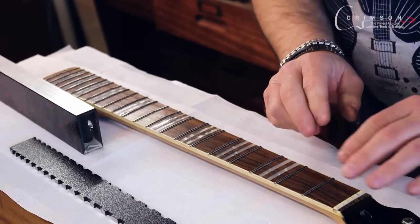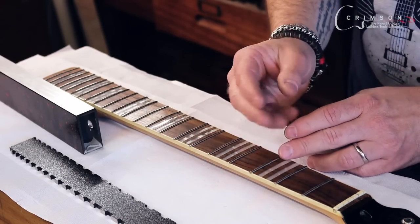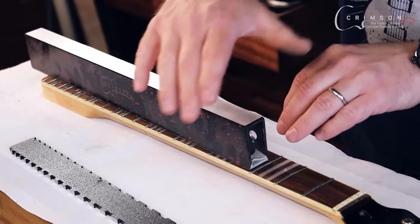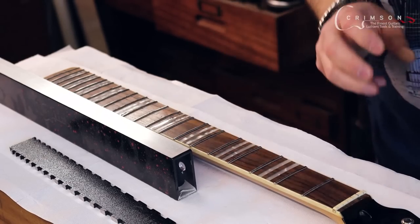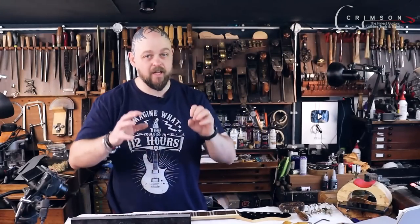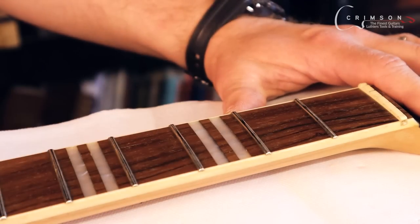When you're working with an unknown guitar, you might end up with a fret that isn't actually properly seated. It's not glued in, and these certainly weren't glued in, but the slot might be a little bit loose, and a particular fret, as you're going over it, might be pushing down with the leveling beam and then just popping straight back up after you've gone through, and that would then give you the rock that we've seen earlier. When you go over with the leveling beam, you should be able to actually hear the difference between most of the frets that are well seated and the one that is loose. And it's sort of a whispering kind of a noise. So I'm doing it evenly over the whole fretboard.